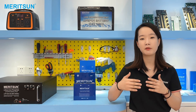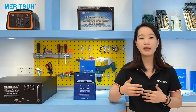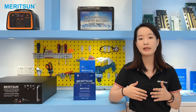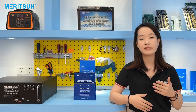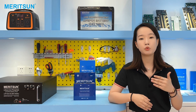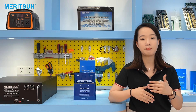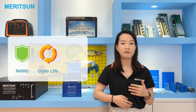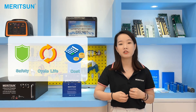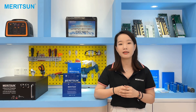That is one main reason why the sales of the LTO battery remain small. In another aspect, the BMS for the LTO battery has not been developed widely in the market. Because the LTO battery cell voltage is 2.4V, if you want to set up a 48V battery pack, you need a 20-21S BMS for control — which is not mainstream BMS technology in the market currently. In conclusion, when comprehensively comparing battery safety, service life, rate performance, and battery cost, the lithium iron phosphate battery is the best choice for assembly in the power battery for the storage market.